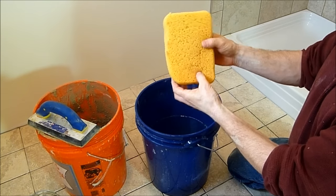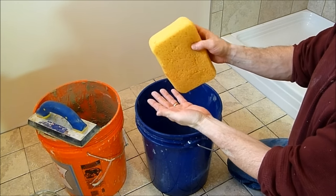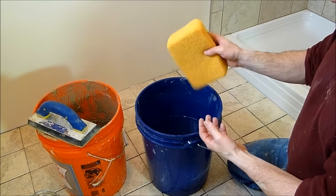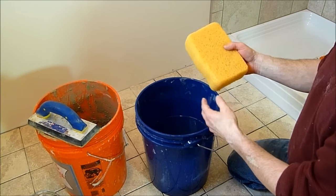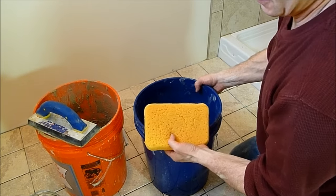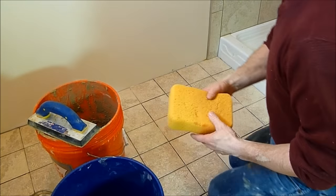I even do this just to make sure there's nothing left. So when I bring it open, there's no water left — it's just damp, and that's it. If you introduce too much water when you're wiping, the grout is going to discolor and you'll get a weaker bond. So let me do some actual grouting here and show you how this works.